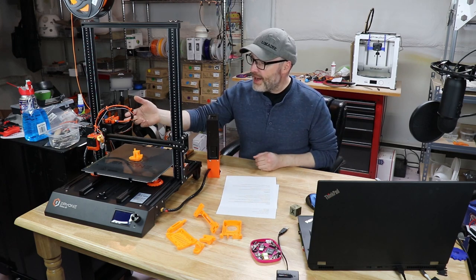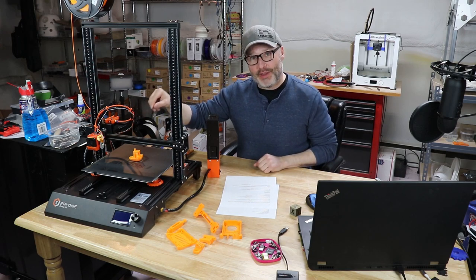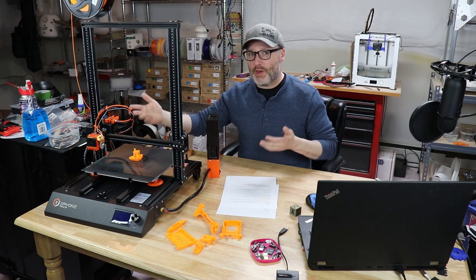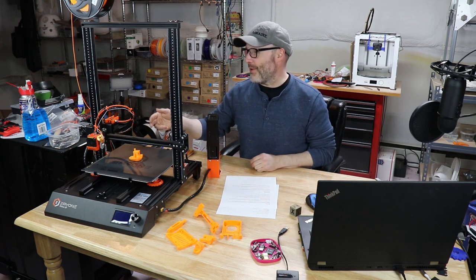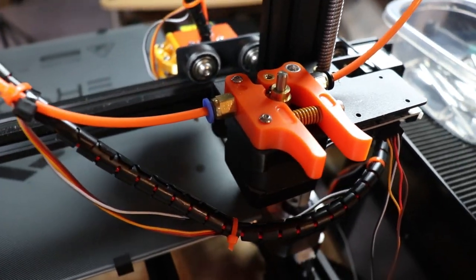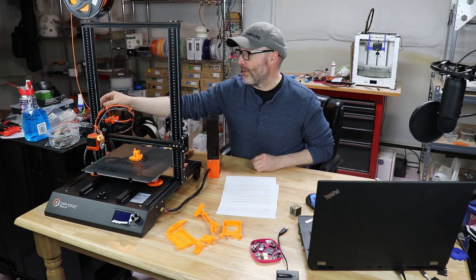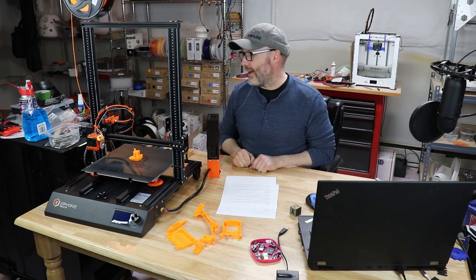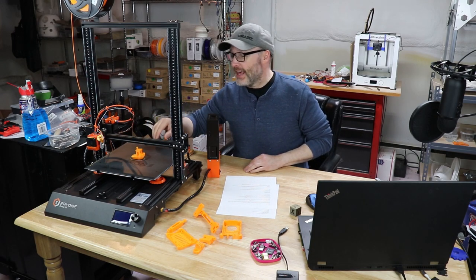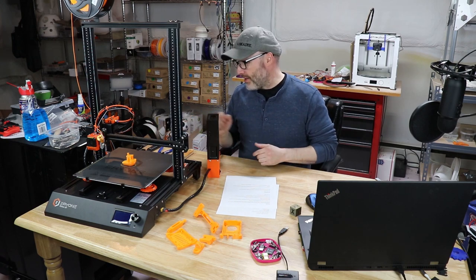The hot end — don't take this the wrong way — it's nothing special, though it does have a neat chamfer design where the filament comes in: rather than going up against a straight edge, it's been widened and chamfered so the filament goes in smoothly. The extruder is just like you've seen on every other CR-10 and similar printers. What's interesting is they added a push-on connector and a section of PTFE tubing where the filament goes in, so the filament won't make contact with the lead screw. This printer also has dual bed rails — the wheels ride on both sides — and so far it's been very smooth, unlike my CR-10s which I've had to tighten up periodically.